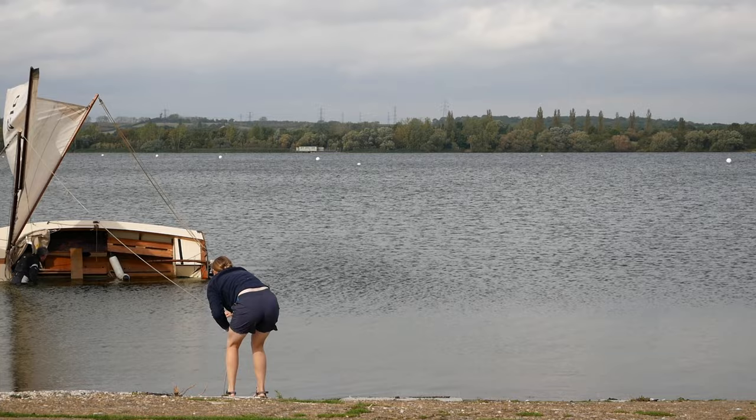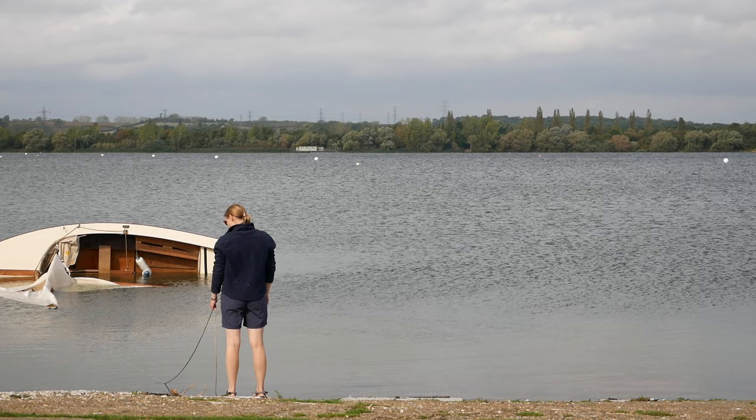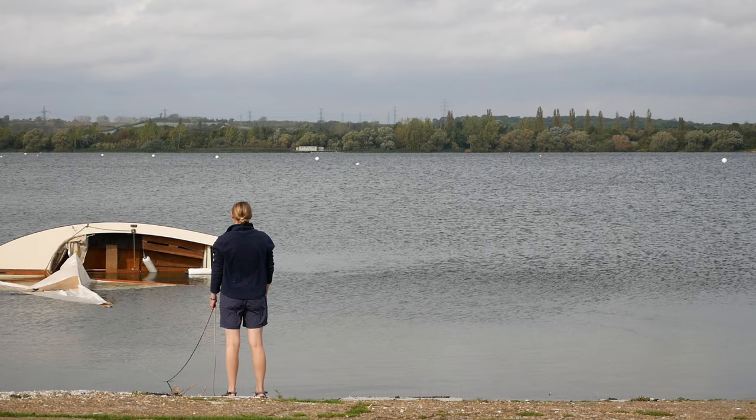A lot of the lessons that I wanted to get from capsizing Tarka, I did get. We saw how she floated, that she didn't want to invert. The mast seemed to hold her comfortably on her side. We saw how she floated when she came back upright again, and how after the first capsize, when the buoyancy tanks were relatively dry, they brought Tarka up high enough out of the water to make bailing quite easy.